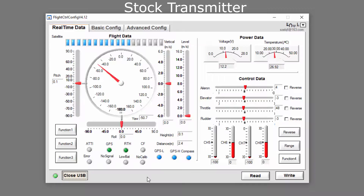Return to home is off at negative 100; when it's on, it goes to zero. Then we have the takeoff button — when you push it, it goes to 100, but you have to hold it for two seconds for it to fire, then it goes all the way back down to negative 100 when not in use. If return to home is active and you push auto land/auto takeoff, it still goes to 100 but won't fire.